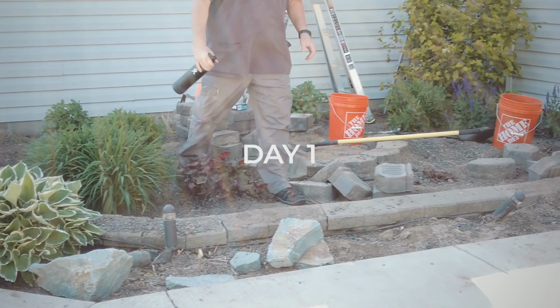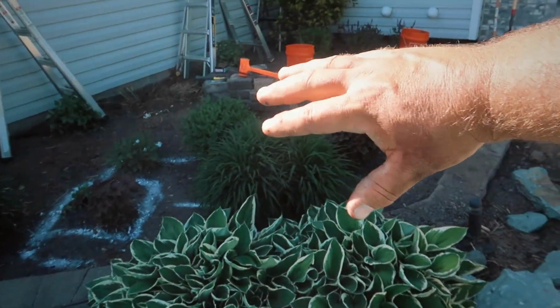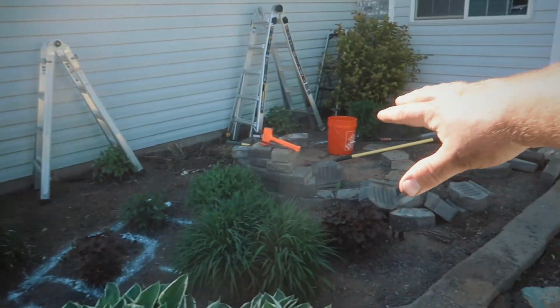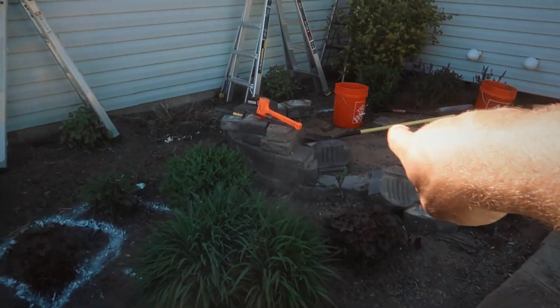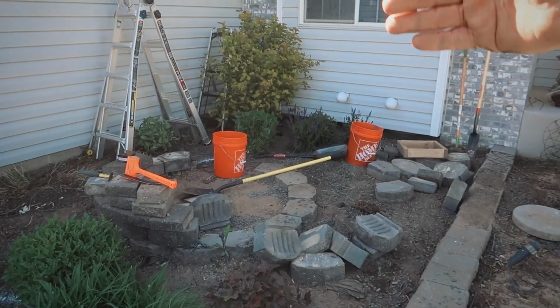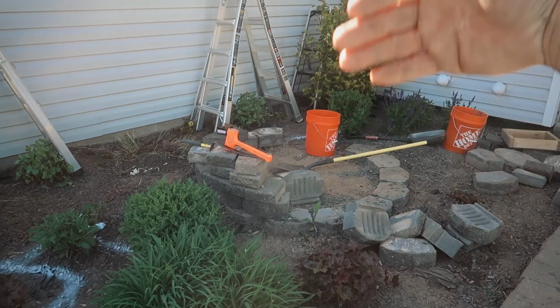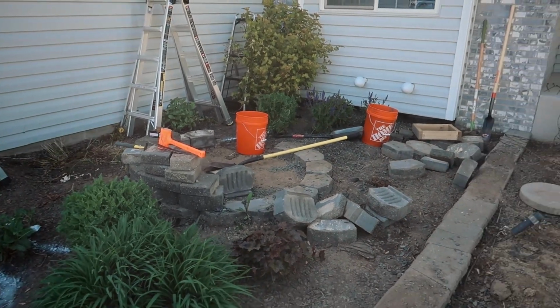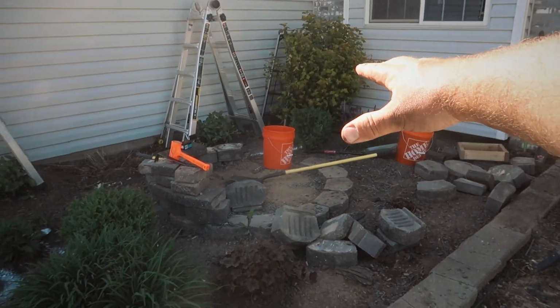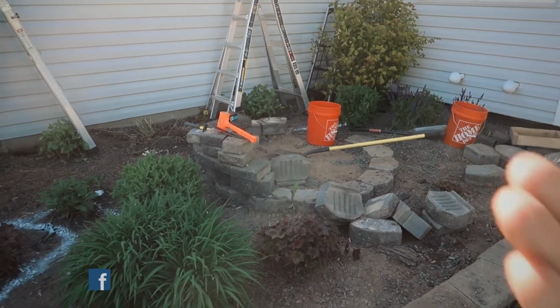Before, we're gonna have a blank slate here tomorrow. We're gonna get all these plants ripped out, take the brick out, and right where I got that white paint line down in there, that's gonna be our starting point. So we've got a lot of stone I've gotta select tomorrow morning to make sure we have our buildup, because we wanna make sure we have thin, stable rocks. And you've seen us use those before, but we're gonna really make sure I get a couple of those in here, because we need to be able to have height without taking too much space up.